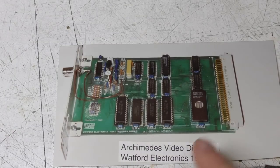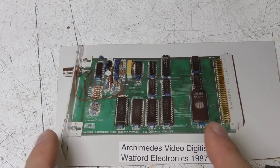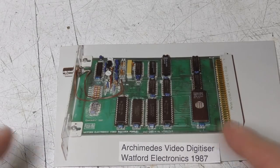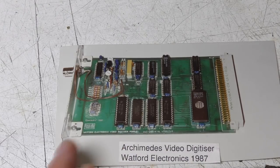And the way I used this was that the video would be shifted into the shift register for the duration of one line, 256 pixels, and then that transfer cycle would be done at the end of the line in the blanking period, so we could get video shifting in at the 10 megahertz video rate and store it all in real time. From memory, I think there were 4 manufacturers of these: Texas, Fujitsu, Hitachi and Mitsubishi.